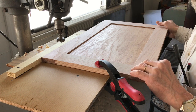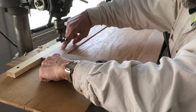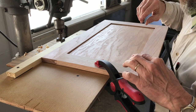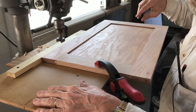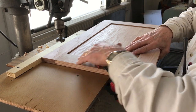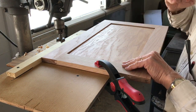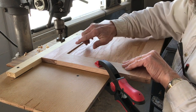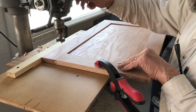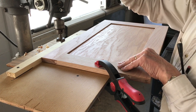We're going to bore the back holes for the European hinges here, using about four inches from each end — you can see down at the other end where the hinges are going to be located. I've got this auxiliary table on there; I wish it was probably about twice as big but this will work for a few doors. I've clamped the door down because that bit doesn't have a very long lead point and it likes to skate away a little bit. I also set the depth on the drill press using the depth adjustment.